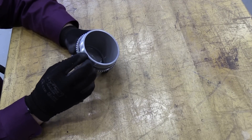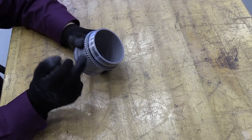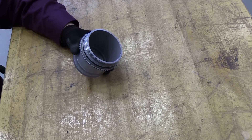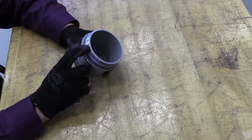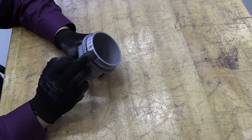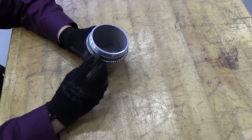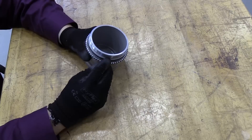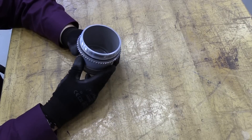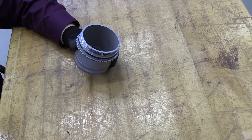The filter cartridge bowl assembly — the aircraft maintenance manual wants you to remove all lubrication from the threads of the bowl, and do removal and replacement of the oil filter packing, which has already been done. And then a full inspection of these threads. The seating surface is here and here. I want to verify that I don't have any damage to these bowl threads whatsoever, and I also don't have any damage to the seating surface of this bowl assembly. If there is damage to those items on this bowl, when you reinstall it, it is possible that the bowl assembly could become seized onto the head. So we'll just make sure everything is nice and clean.